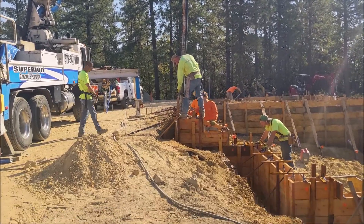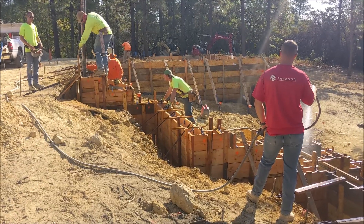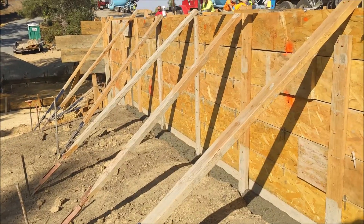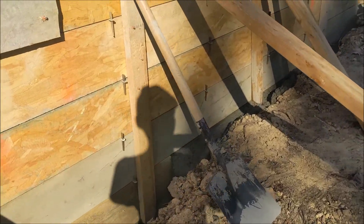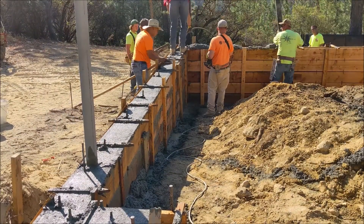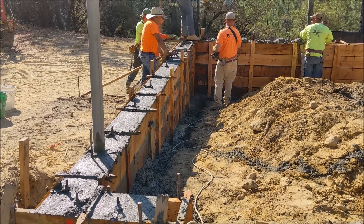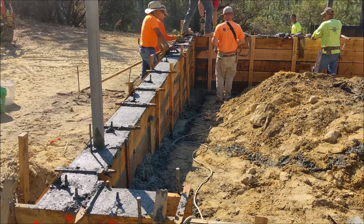You can see the mobility in that pump truck — how you can just move that boom anywhere you want and fill accordingly. They're hosing everything down to keep it wet so the lumber doesn't suck out all the moisture as the concrete goes in. The guy with the remote on the left of the screen is controlling the boom. The guy on the right side is holding the hose and filling up the foundation and stem walls. The guy standing on top has an electrical device called a stinger that vibrates all the concrete down — he puts it into the wet concrete and it shakes around and makes the concrete drop down.